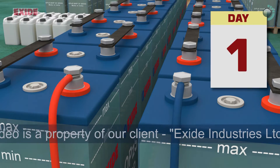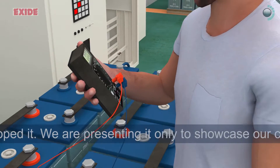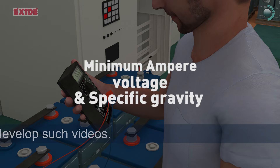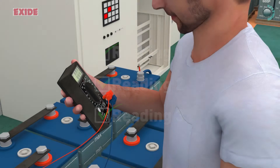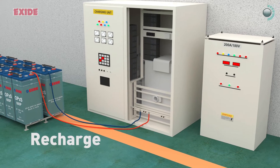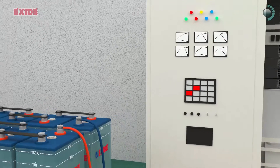Next charge for 3-4 days as per recommendation with monitoring by skilled and experienced manpower to avoid permanent damage of the battery. The completion of the charge can be known when the minimum ampere hour input is given, the voltage and the specific gravity is constant in 3 consecutive readings and all the cells should gas freely and vigorously. Next connect the entire battery bank to resistive load to discharge the batteries and then immediately recharge them as per prescribed voltage. Finally adjust the acid level and specific gravity of the acid as per the IFC manual, and put the battery bank to commission.